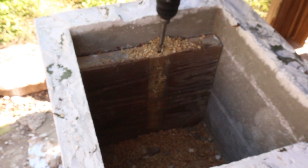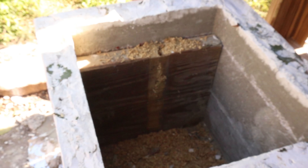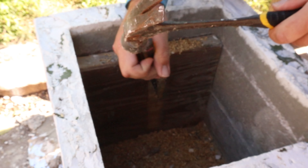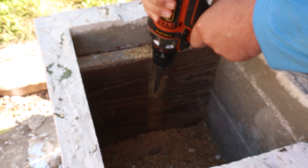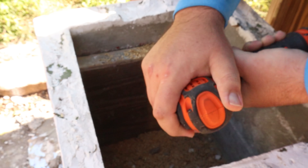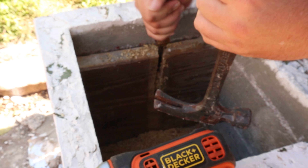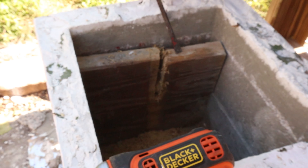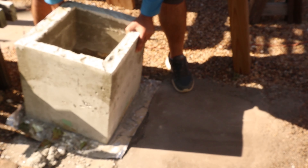What I had to do was do anything I could to remove these boards — I ended up drilling, cutting, and chiseling. It was pretty labor intensive. I came to the conclusion that it won't hurt anything to leave the bottom pieces of the form in there, because generally on these big planters some of that space is filled with mulch or gravel anyway. The longer the boards dry out, the easier they are to take out, but I let this form sit about three days before I started taking it apart.